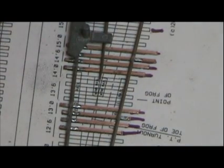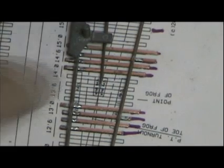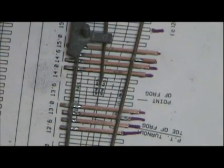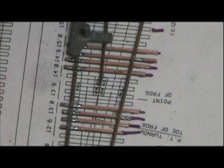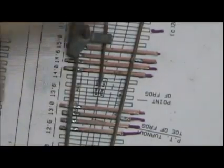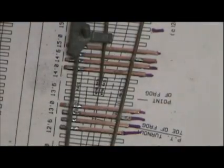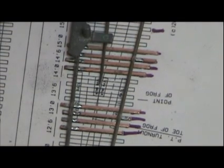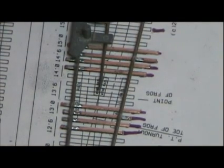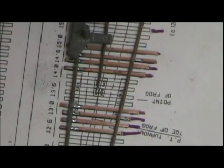Sometimes, if the angle isn't right, if it doesn't match, you have to take this out again, refile it, maybe at a shallower or steeper angle. Or if you totally screw up, I've cut this rail a little bit longer, you can just nip it off and start again, if you feel you really totally screwed it up. But looks like things are pretty close. Let me see.